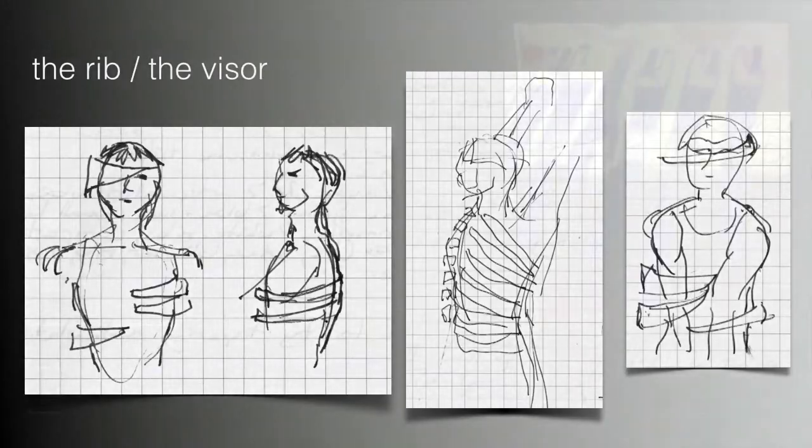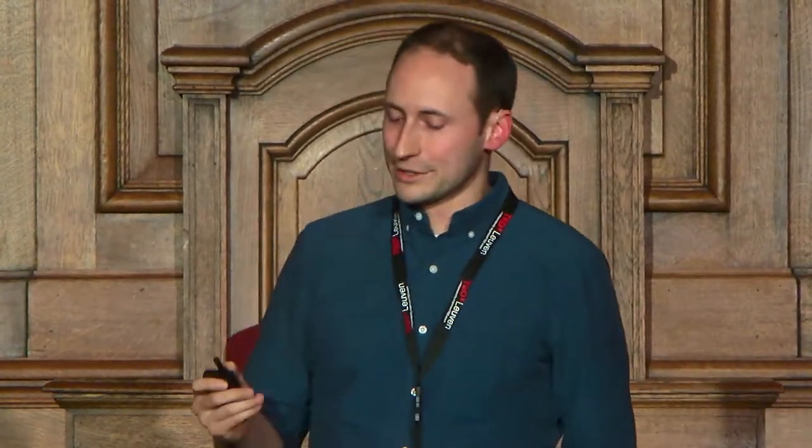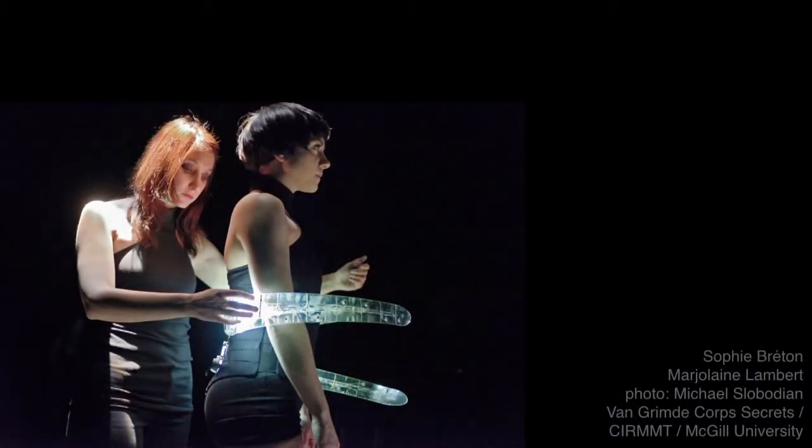We built two different kinds of instruments. The first we called the rib and the visor — the T-Stick now became a sort of shell around the body of the dancer. We used laser cutters and 3D printers — digital fabrication techniques — to quickly tweak a design and create a new version to try with the dancers. The final versions are made from a solvent-welded sandwich of acrylic plastic and polycarbonate. We extended the T-Stick's capacitive touch sensing so that it worked with transparent materials. Each instrument also tracks its orientation in space and movement, and can be used as a handheld instrument or merged with the dancer's body by being attached to their costume — at which point perhaps the dancer themselves is an instrument playable by another performer.